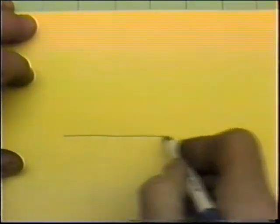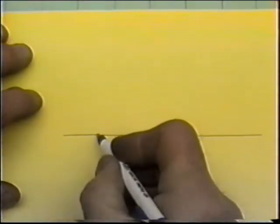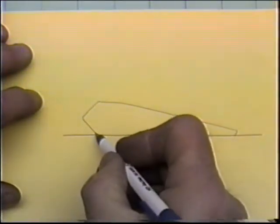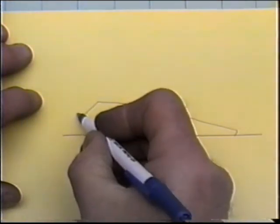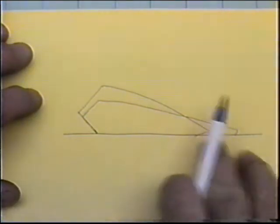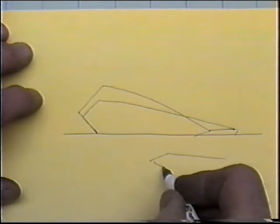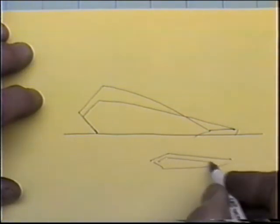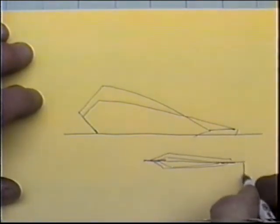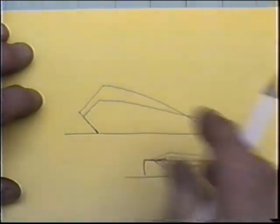This is one real quick concept. We're going to build this elevator flat on a table, but if you build a tapered elevator flat on a table, it guarantees that you're going to have a warp. No matter how you do it, when you're building on a flat table, you need to block up the trailing edge. I'm sure I'm not explaining this the way it should be, but the only elevator or flap that you can make on a flat table is one with no taper.